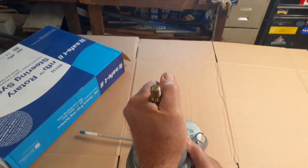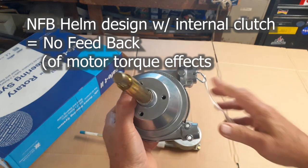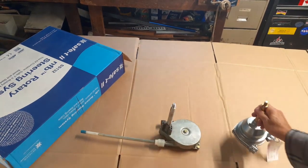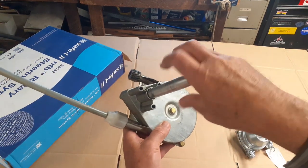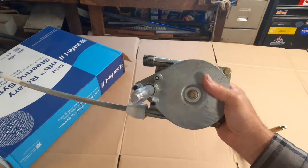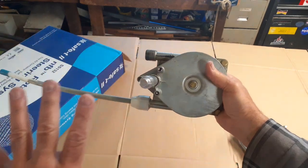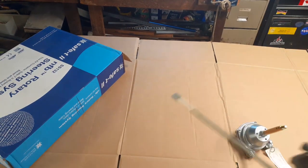Some of the coil runs out into the tube, and the plastic protector is there to keep the grease clean. Right now this one is locked up — I believe it's to do with the clutch mechanism, and I believe it'll free up once you push the cable through. This one, on the other hand, is all loose. There is a clutch in there that isolates you from any torque from the motor — the push-pull — so that you can just turn the wheel and leave it, and then it is locked in position.